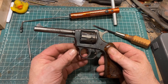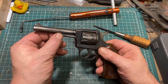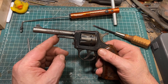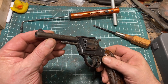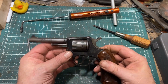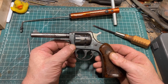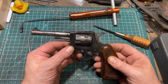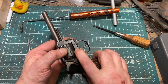Over the years there were numerous changes. One I already mentioned is the bizarre grip frame. Another is that they shortened the cylinder pin, because it really doesn't need to be this long. The change from the octagon to the round barrel was a cost-saving measure. And other than that, it's very typical of H&R revolvers: a solid frame, all steel, separate trigger guard secured by pins — really just a very simple, robust, useful little gun.